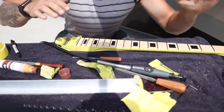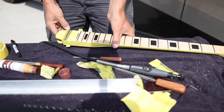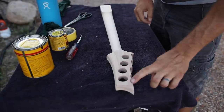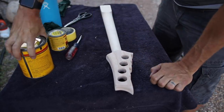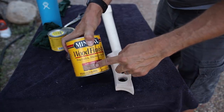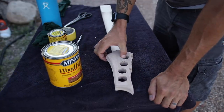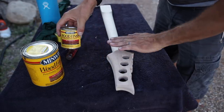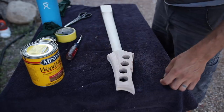Let's get started on the finish. Since this red oak didn't match the sapele mahogany on the body, I'm going to stain it to match using Minwax Early American. It's a tad more brown than the body wood, but it has a red tint so I think it'll be fine. I also have some red chestnut if I need it a little more red. The masking is just a fail-safe to keep the stain only on this portion.